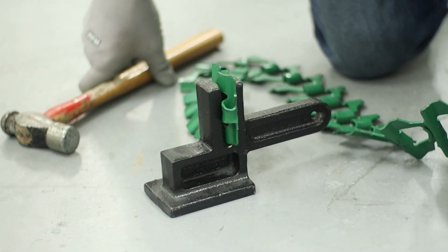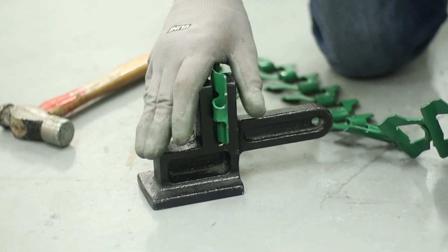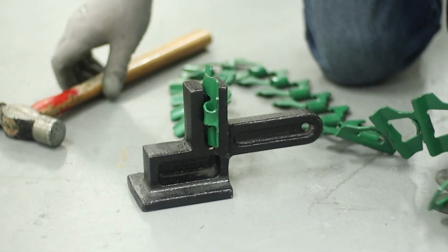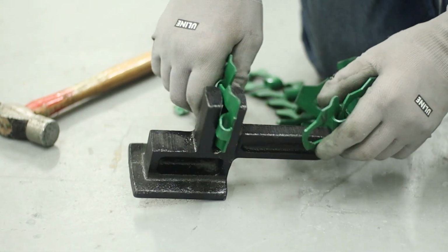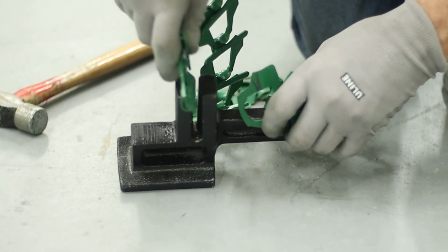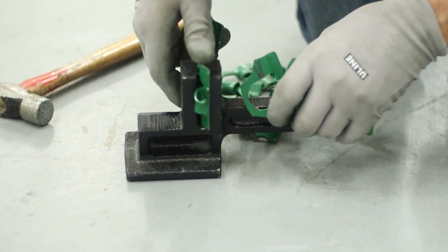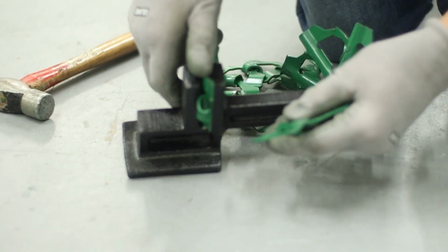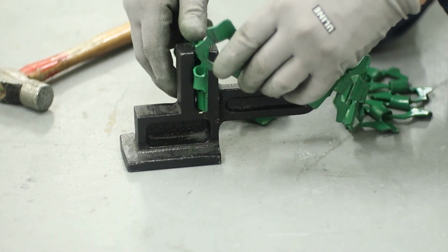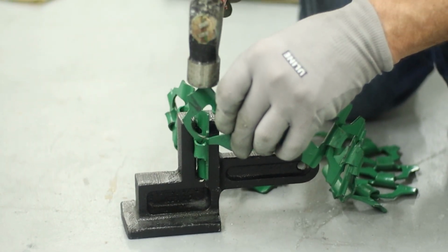So when you're putting the chain in, you're going to have to put several sections together. You're going to want the chain splitter that you can get through the VAL-CO parts system. To put these together, you can see there's a longer V here. You're going to slide this chain in this way so that it bottoms out, and then we're going to slip this one into this open side of the link, and we're going to start with it at an angle so that you're hitting straight down.